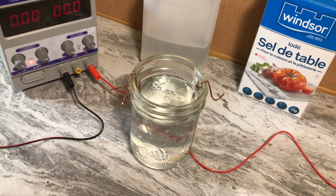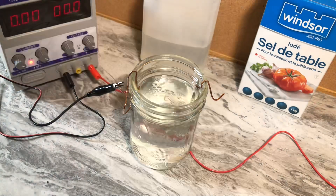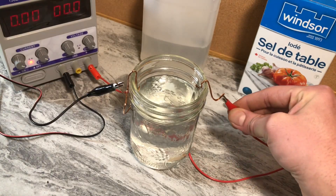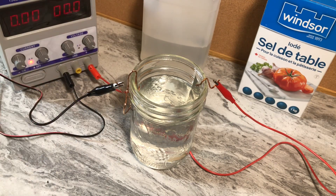Black is negative — it's marked on the cathode — and then you connect your positive to the anode. The higher voltage you crank this to, the faster it's going to work. That's why I recommend a power supply over using batteries. A lot of people online use batteries, but batteries can only put out so much voltage. With a power supply you can save yourself hours — what might take two hours with batteries you can do in 20 to 30 minutes. The better your solution, the better your plating will turn out.